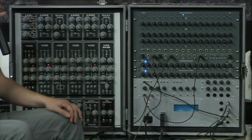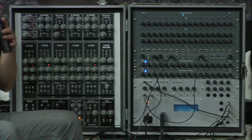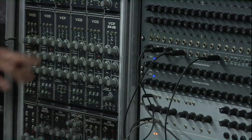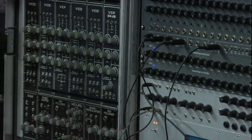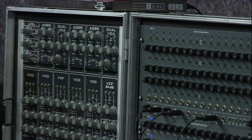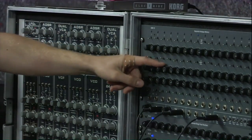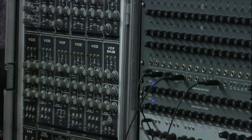Yes. That's working. So you can do that without adding any synthetic tone to it? Yeah, you can. If you turn down the oscillators like this, the only thing you will hear is the signal which comes into the filter, and the only thing you will hear is the filter. But of course, when you get an external trigger going, and your sequencer runs in the strange way of the drummer playing, then of course you can again make the same thing that we did now, and you can again apply, let's say, a filter to the trumpet that is going through the other filter.